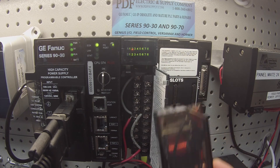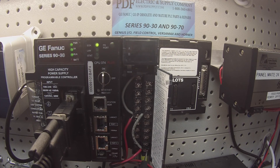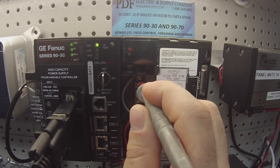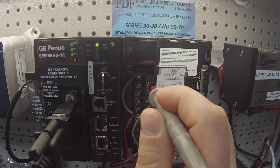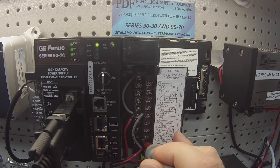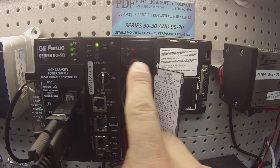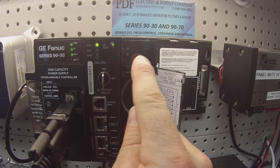This responds to 24 volts DC. That pretty much tests that this is working properly. The next thing, of course, is just the opposite — I want to make sure that all of my points, all 16 channels, can be turned off and actually stay off, because that represents the other problem. Sometimes it'll seem that you have a zero bit in the location, which would suggest the channel should be off, but it really isn't. I'm going to touch my positive lead just to give you an example. If you hear one of these turn on, then obviously something is wrong — it's stuck in the on position. So far these are all off. I'm able to turn them all on, turn them all off. I don't have any false readings or false information coming from the user reference LEDs on these A and B channels.